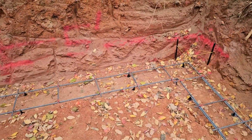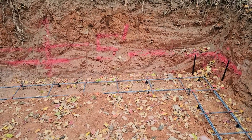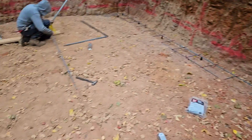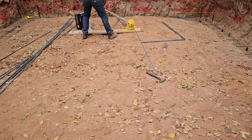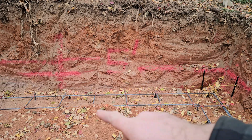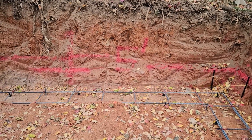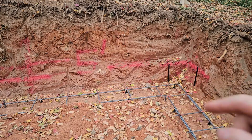We've got the five-foot wall in this section here. For our upright rebar, we're going to bend a three-foot section across this way and then five foot up. So we marked our rebar at eight feet, cutting it at eight foot and then bending it at the three-foot point. That way those tops should be pretty close to what we need them to be. We might need to cut them off a little bit later, or add on using that two-foot overlap, since these cells are going to be filled with concrete as well.